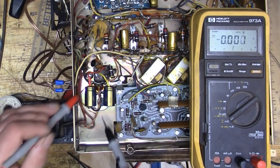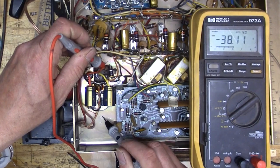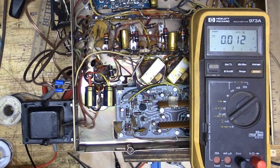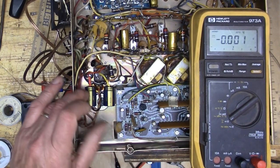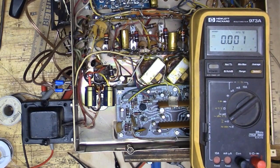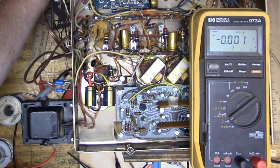and I quickly realized what the problem was. These have to be, the minus has to be going to the outside of the rectifier like that. Otherwise, these things just started pulling a bunch of current. So I don't know, this one's a little oversized. This one is the size that it originally had, but I think it could be a little bit bigger, but I didn't have anything. So it's actually sounding kind of good.